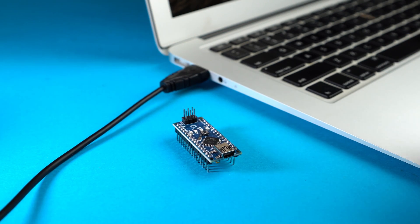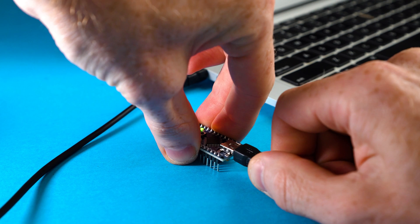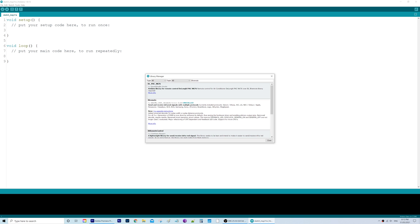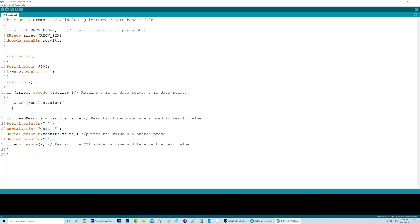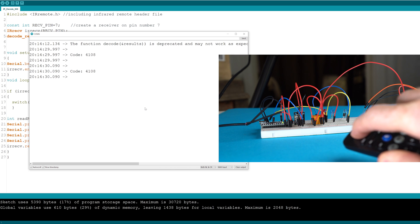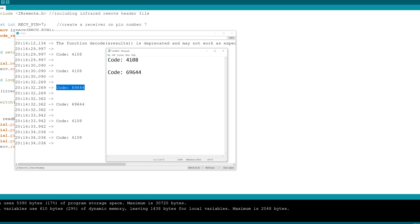To get the first step working we need to extract the codes from the infrared remote so they can be used later in the code. Connect the Arduino to your PC with a USB cable and load the Arduino IDE software. Next, download the IR remote library — there'll be links in the description. Once installed, upload the following code onto the Arduino Nano microcontroller. This makes the Arduino work as an infrared decoding tool, reading and outputting as text what each button press sends. Open the serial monitor to see which codes are displayed when sending infrared signals with the remote. Copy and paste these codes to notepad and save them for later.